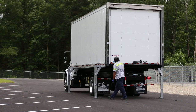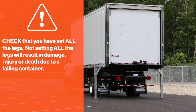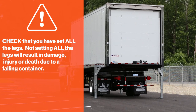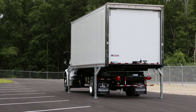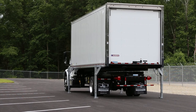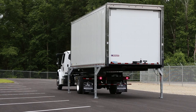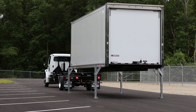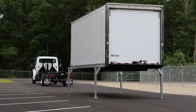Check that the locking hooks are unlocked and in the down position. Check that you have set all the legs and they are pinned correctly — not setting all the legs will result in damage, injury, or death due to a falling container. Return to the cab. After double-checking that all people and objects are clear, pull straight out until the chassis is clear of the container. Do not turn the wheel until you are free and clear of the standing container. Note that the alarm and light will continue until another container is properly secured to the chassis.